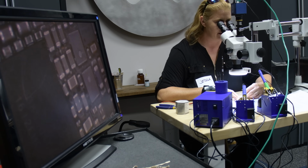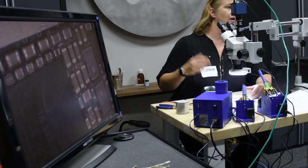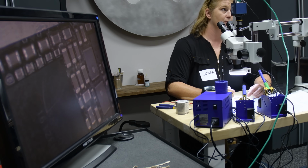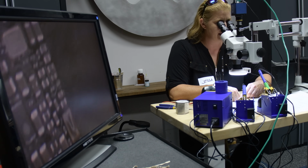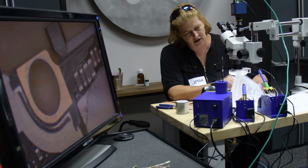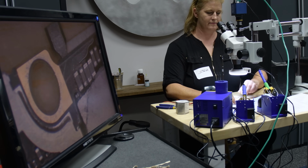So that does make sense. And so these two were then missing, presumably because someone measured and knew that they were trying to solve that problem and not just randomly because of physical damage. But now we don't really know. But let's assume that they did have a VCC main short and that removing those caps solved that problem. In that case, you might get the phone to turn back on. So now we've got a little bit of a picture of why what was done. And when we get back down here, this guy is on a completely different rail as well. So again, it's unclear. That's on a NAND power rail. Needs to be there, but just taking that guy off, unless there's a short, doesn't really make a lot of sense. So that's where we are now.